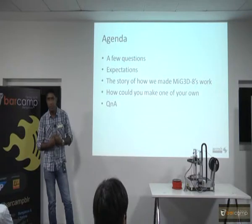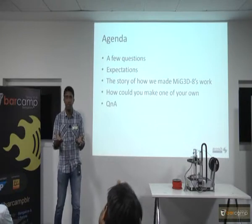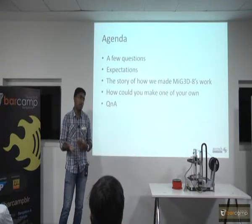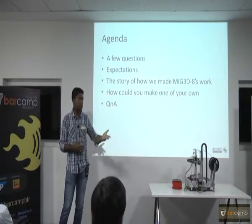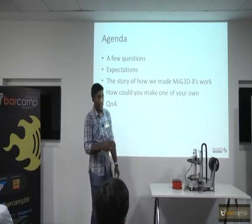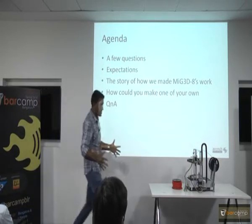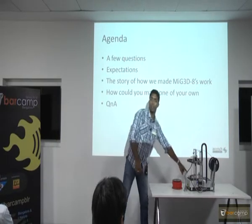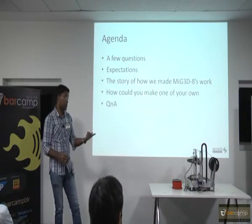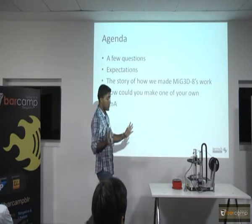The open source concept in hardware is like you buy one of those pieces — you buy a design or a kit essentially. You get the design drawing files free, so you could download it, modify it yourself and do improvisation. This currently has one extruder — this portion is what we call the extruder. You could make it two so that you could print multi-color. You could make the whole structure much bigger — right now it is 200 by 200 mm, you could make it 400 by 400 to print a bigger part.